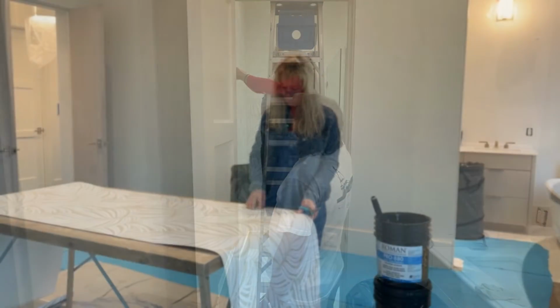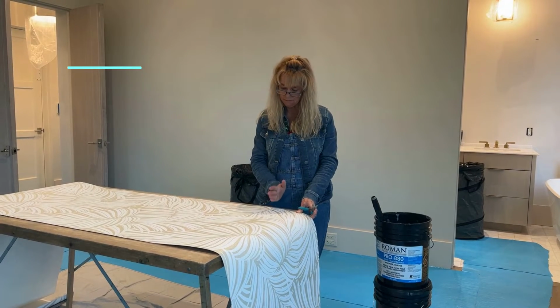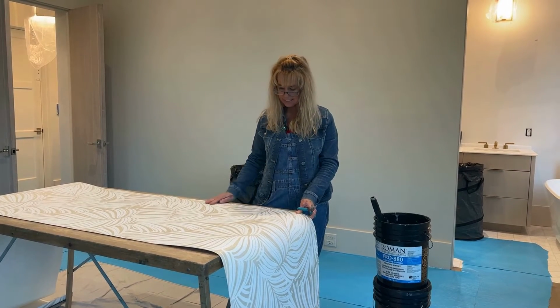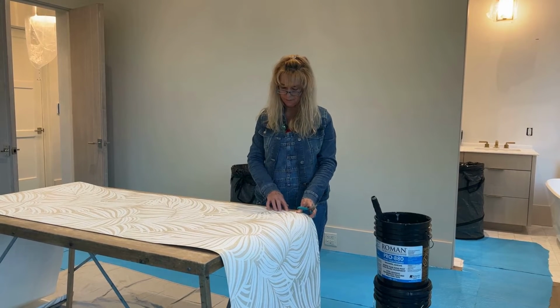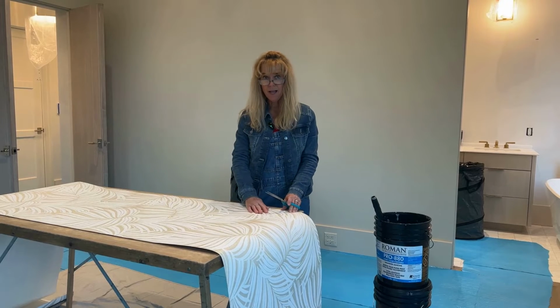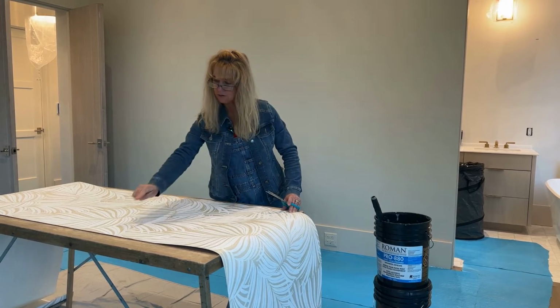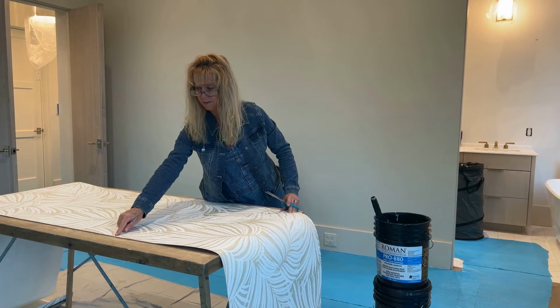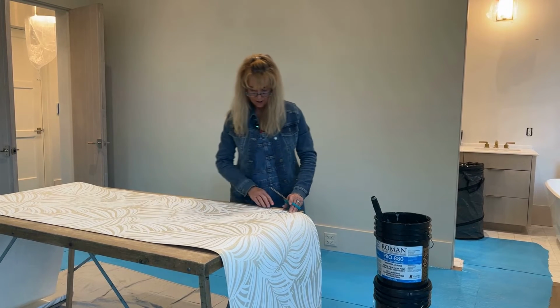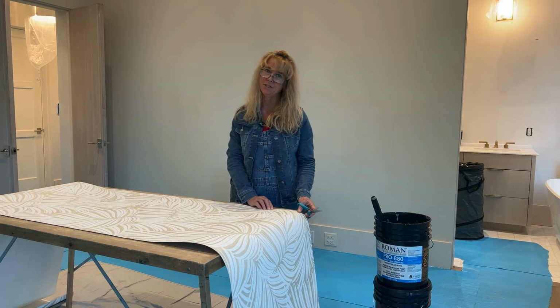Okay, so without taking anything off at the bottom, when I pulled it up, it came right to almost the middle of a leaf, and I didn't think that would look good, so I pulled it up about 6 inches, and then I look on this side. This will be my A, and remember we have a drop match. The next one will be a B. So I can look straight across from here, a little bit down, and I'll see where the match is going to be.